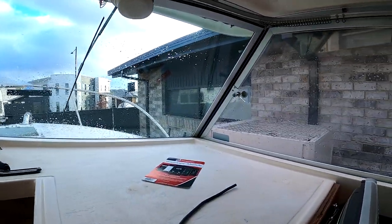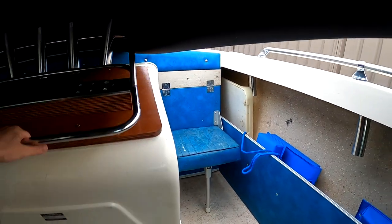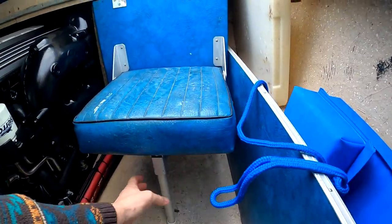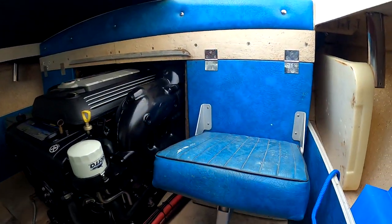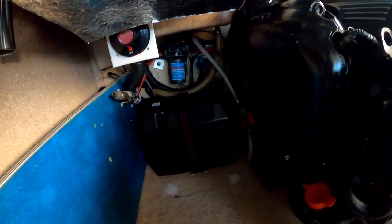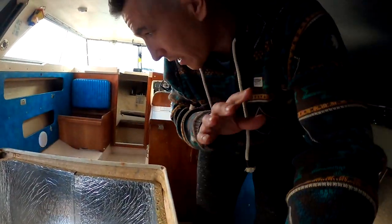I put new rod holders in. Inside the boat, apart from filling a million holes — which is still continuing — there's a new battery. The engine has been serviced. A bunch of wiring has been tidied up under there, batteries put into battery boxes. This side is a lot tidier now — all wiring is up off the floor. The isolator switch was moved so it doesn't get wet, because the wires were literally just running on the floor before.